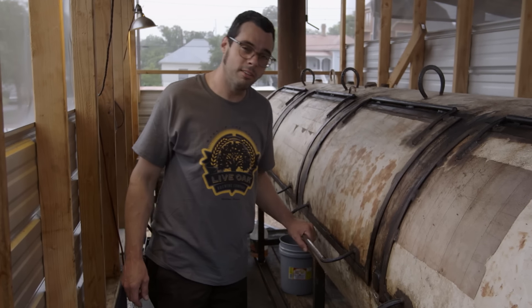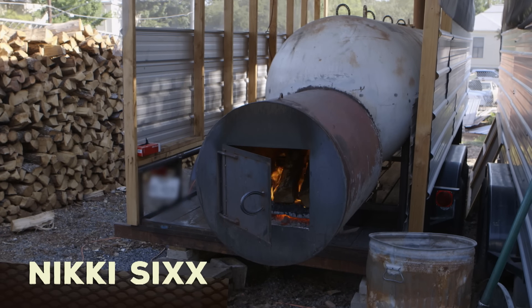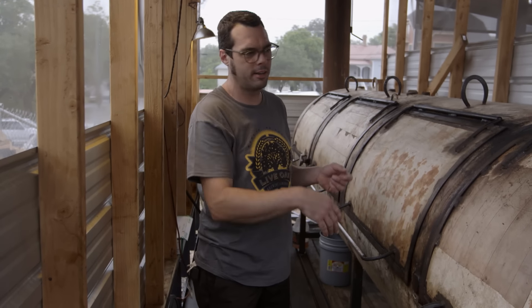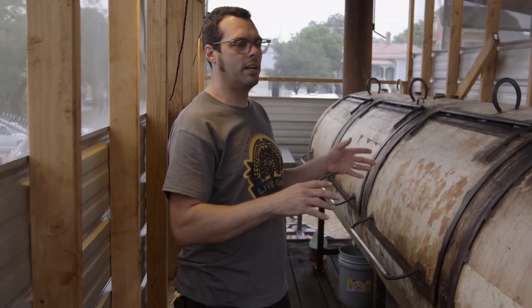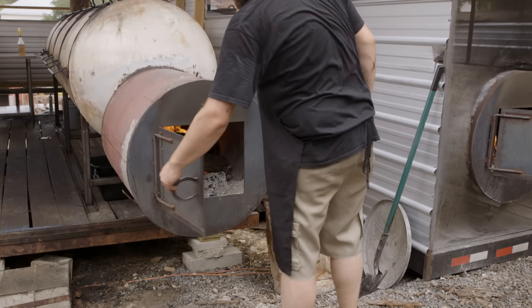And this is the new favorite — named Nicky Six, kind of the baddest of them all. With each cooker you make little modifications: maybe raise up the grates, cut a bigger opening at the firebox, or move the smokestack a little bit. Even a quarter of an inch makes a huge difference. The way I build these cookers is with a concentration on convection — you don't want baffles regulating airflow; you just want tons of natural draft coming through. This has become a really, really even good cooker, and these days it's my favorite.